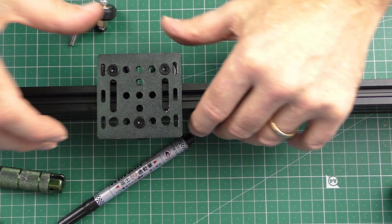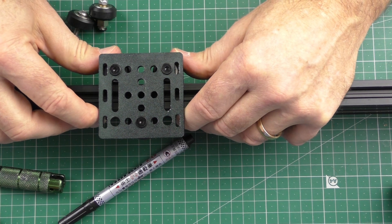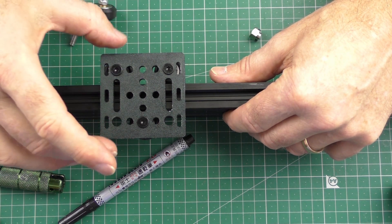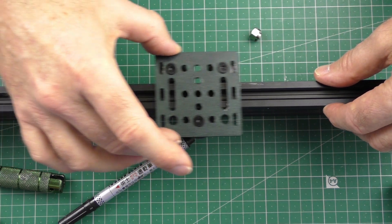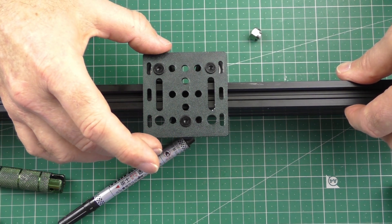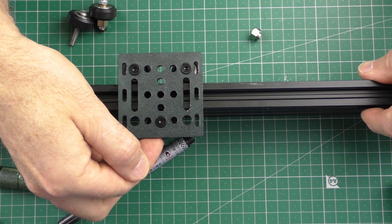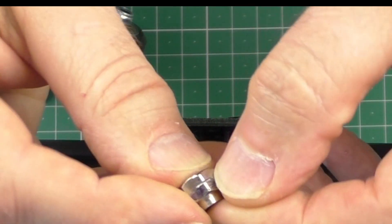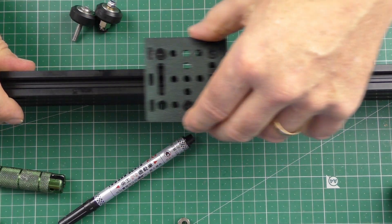It's important that you don't over-tighten. When you start printing in the morning, just run your carriages up and down — they should feel smooth. You shouldn't feel a notch at around 50mm, and that's the flat spot generated overnight. If it's not too severe you can move the carriages backwards and forwards about 10 times and that flat spot will disappear, but then you need to take some tension off your nut. If you've marked it like I did with the marker pen — or what I actually do is use a hacksaw cut — you'll know when that mark is at its weakest position.